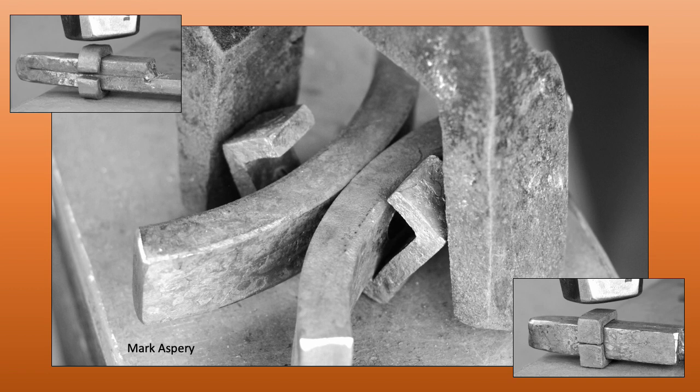Here are my steps in making the forged collar. As you chamfer the edges of the scroll work you can also chamfer the edges of the mandrel, and that goes a long way in helping prevent cracks as you forge this collar. The cracks will form at the corner if you work over a sharp edge.